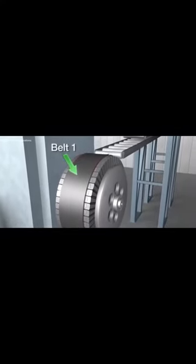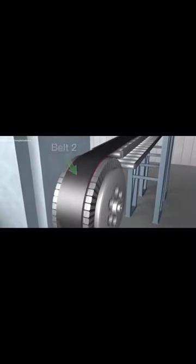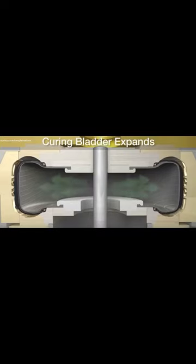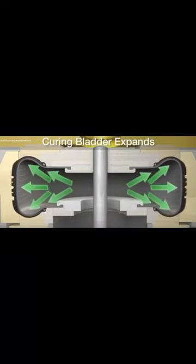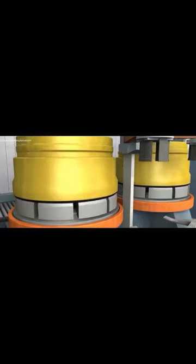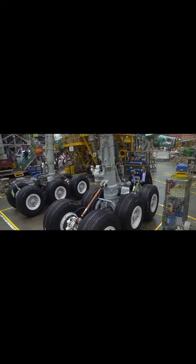The buff line cushion is constructed of a rubber-based material to improve adhesion between the breakers or casing plies and the tread reinforcing. The final process is vulcanization, which is used to join the tire components together. By adding crosslinks, the vulcanization process chemically transforms polymers into stronger materials.